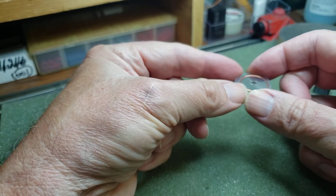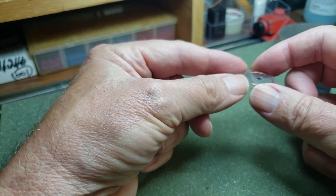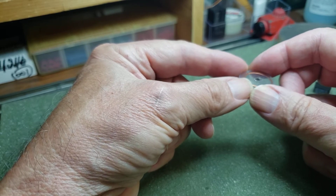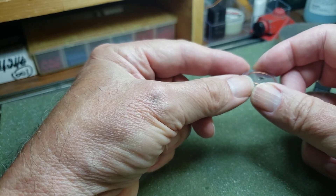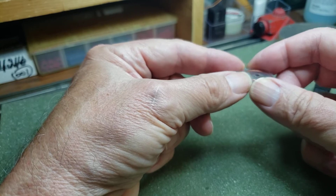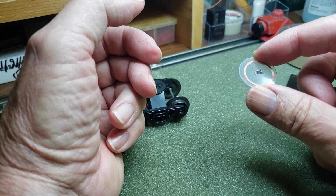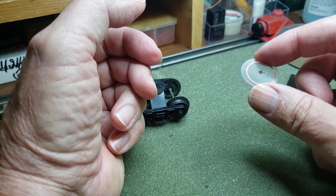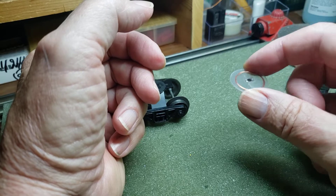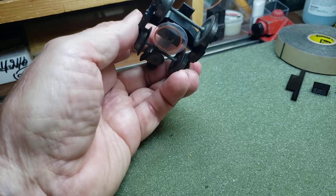Without interfering — for example, without catching on one of the switches. I've generally found that if I mount it about one eighth of an inch above the track, with the actual tag detector antenna mounted just under the track, that seems to work fine. I do use tubular track on my layout; anyone who uses other kinds of track might have to do a little bit of experimenting.